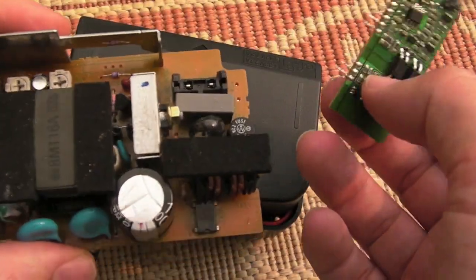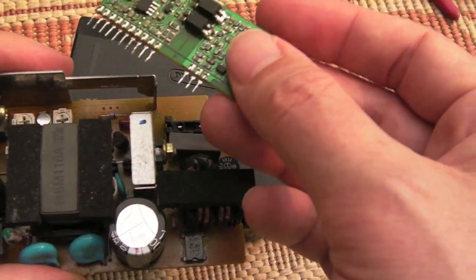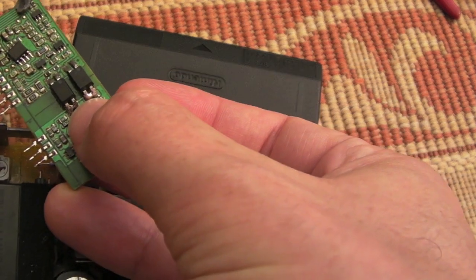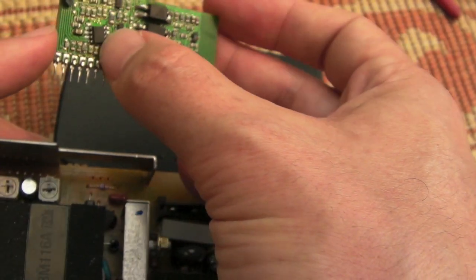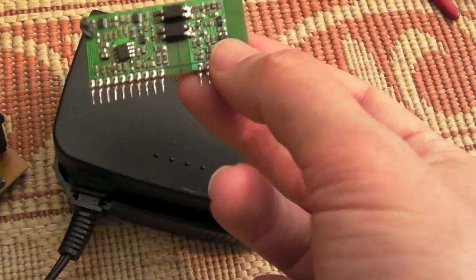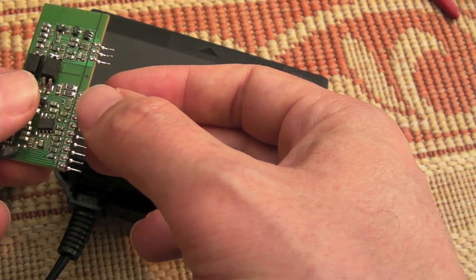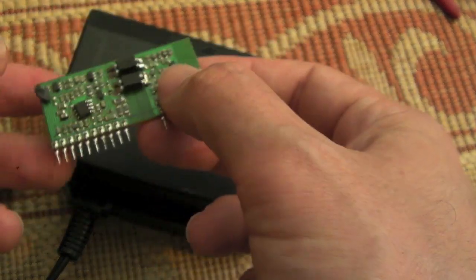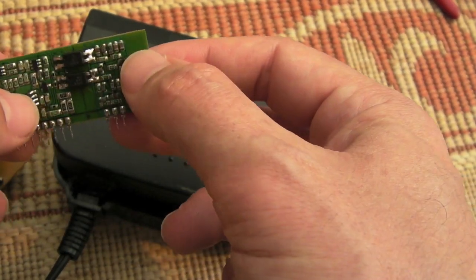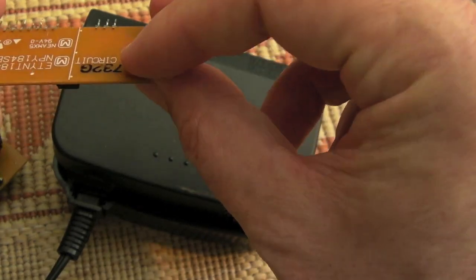It's just really annoying because you can't measure anything to understand what the hell's going on, because this is shutting the damn thing down. You can see I did solder there to try and disable the shutdown process, but I still couldn't get anywhere with it. And that chip there's misaligned because this was the nearest thing available the other day when I wanted to do some SMD solder and test the airflow on the hot air rework station there. I thought I'll just quickly heat that chip to see when the solder melts. So I need to put that back on there if I'm going to keep that board.